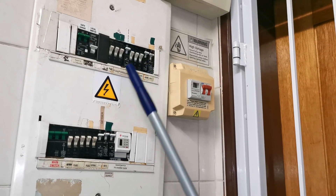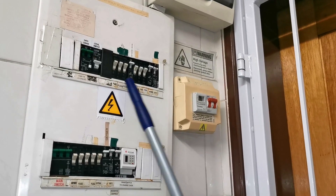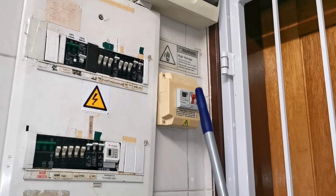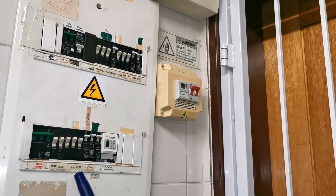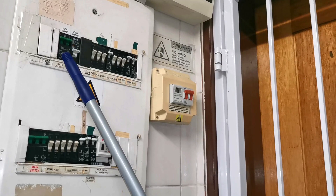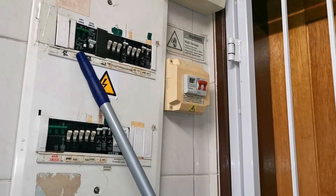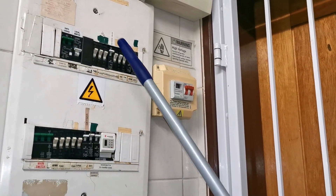Only in the event of load shedding and it's a really hot day, I've got my 18,000 BTU aircon here with its 20-amp breaker. This changeover switch will switch the aircon as well as the swimming pool pump - a 1.1-kilowatt pump. If it's a beautiful sunny day I will manually change over and run both. The only issue is I've got to switch off my earth leakage when I change over, otherwise the neutral conflict will trip it.